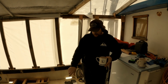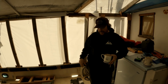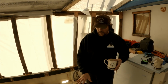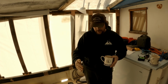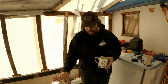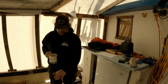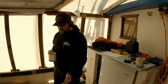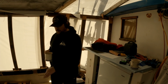And in the meantime, we'll start fabricating all the covers for the shaft alley, laminating the new bulkhead, and that can go in pieces for the most part. We can work our way towards the center, and we leave that open, and then once that intermediate shows up, we can drop it in and get it in place, and we can finish the bulkhead. We can start buttoning up the major part of the shaft alley. It's going to be in several pieces, so we can start installing those pieces. We have all the sumps to do, so it's not like this is holding up the project at this point. And then once that's in there and set in place, we can put in the bulkhead.